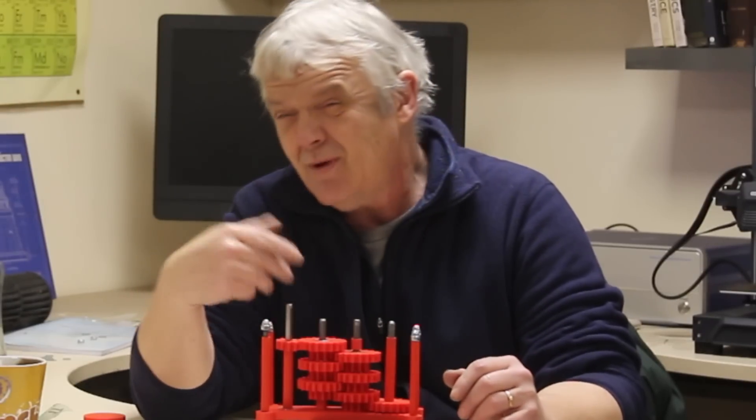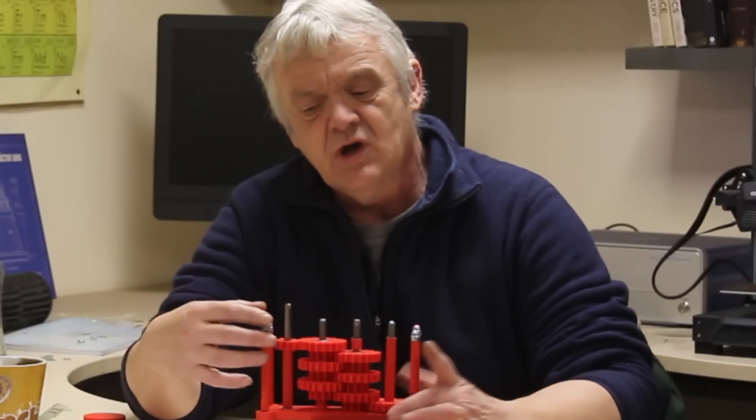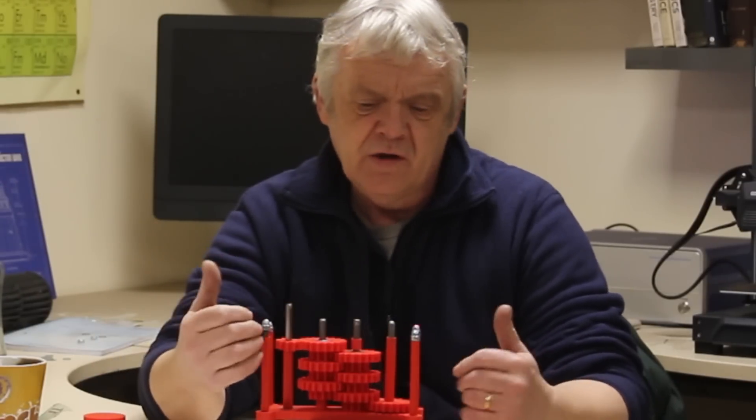Before I put the top plate on — I've done this as a 2:1 gear ratio, but you could do 3:1, 4:1, 6:1, or any ratio you like, as long as you keep in mind the module and wheel size, which govern the ratios through the reference circles. That's my drive gear and this is the driven gear — I'm strong but slow, so I turn this and get high speed out to run a generator. But gearboxes work either way: make the fast side the input and the slow side outputs massive torque, useful for something like a winch.